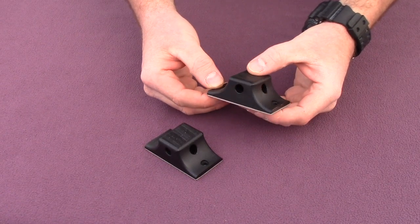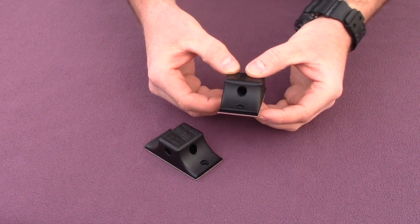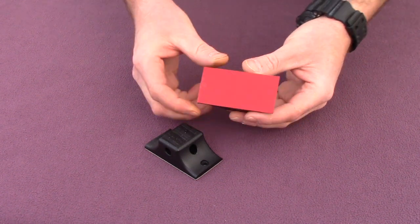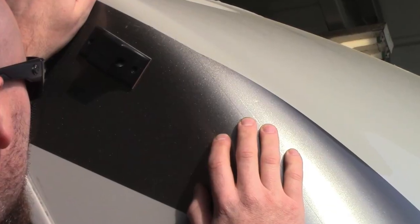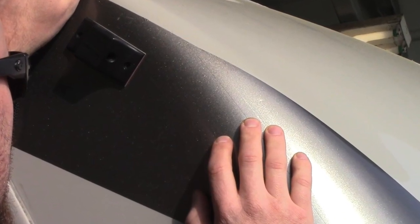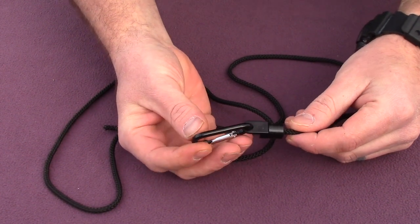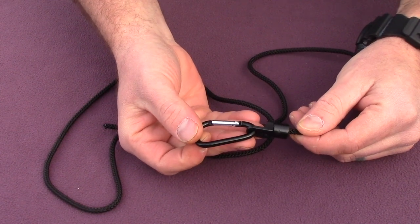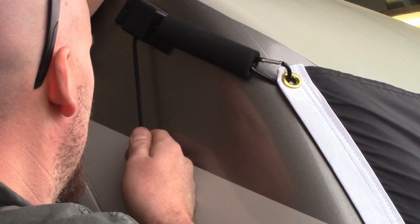The top blocks are the anchor components that support the top two corners of the banner. They should be mounted on the top side areas of the molded nose cap using the high bond tape and the stainless steel screws which are included in the kit. There are two hoist ropes which attach to the two upper corners of the banner and thread through the blocks and run downward toward the cam cleats.